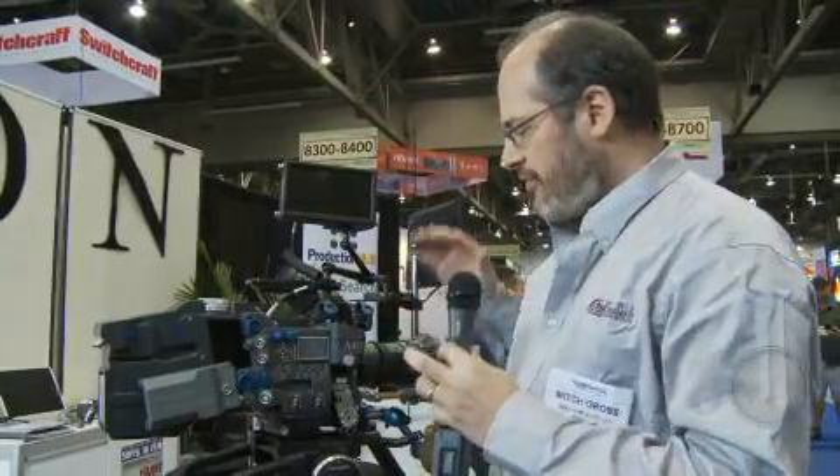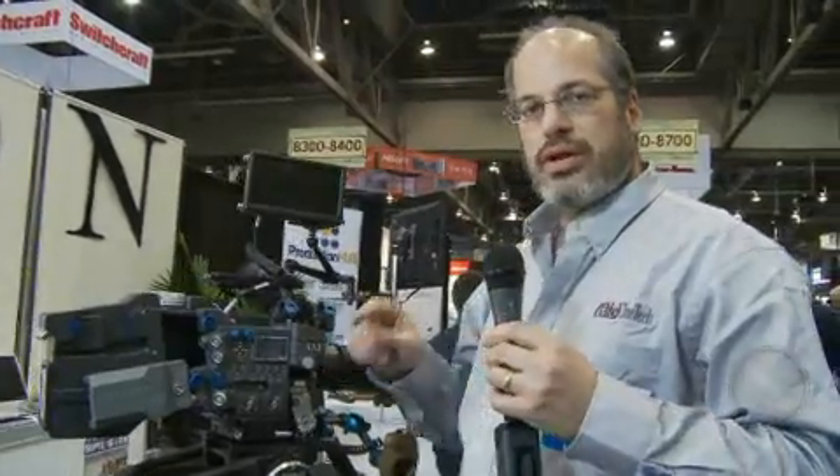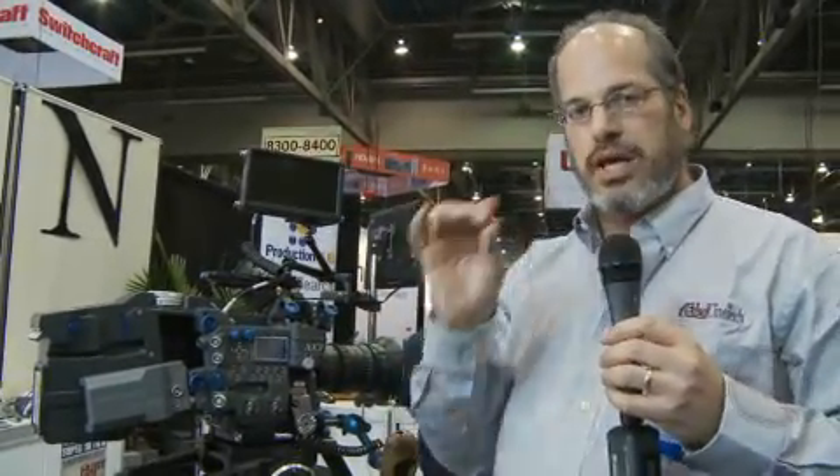There's really high functionality, too. The sensor is beyond 4K — we'll know exactly how far beyond when it delivers next year. It's a DALSA CCD sensor with a global shutter, an evolution of what was in the DALSA Origin digital cinema camera, purpose-built for Aton's design. The sensor has dual sensitivity: it's an 800 ISO sensor but can also work as a 100 ISO sensor with no loss of dynamic range — 13 stops of dynamic range on this camera.